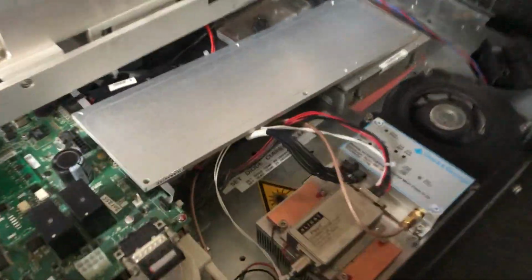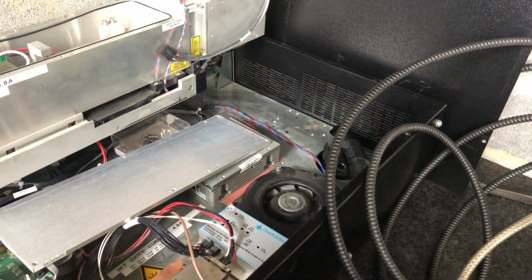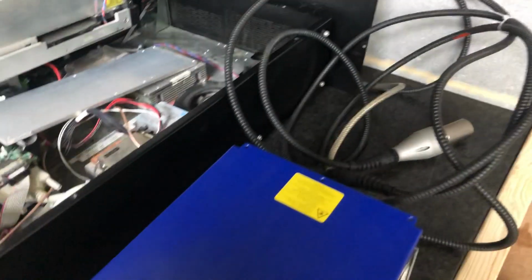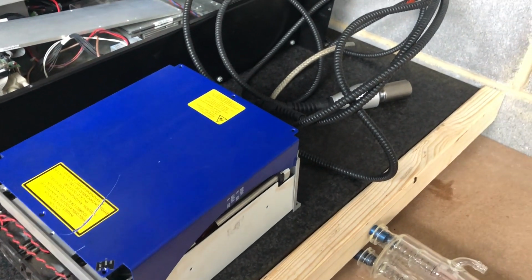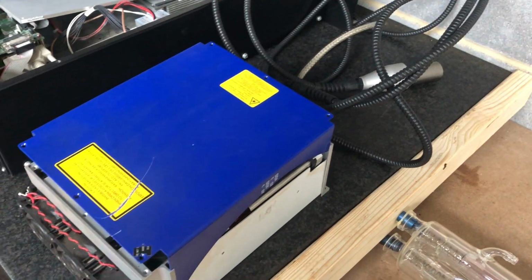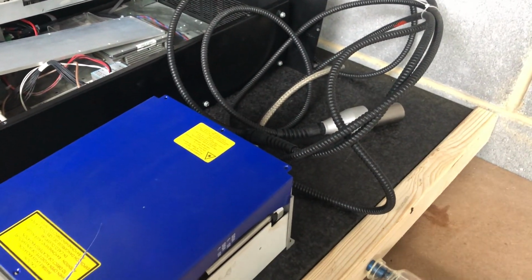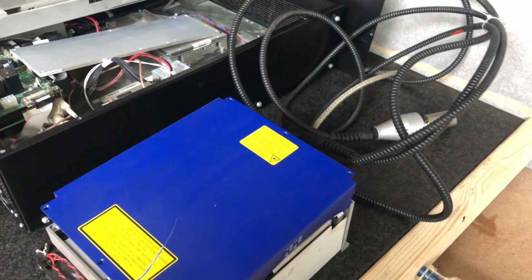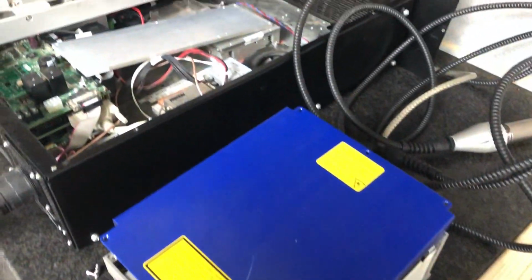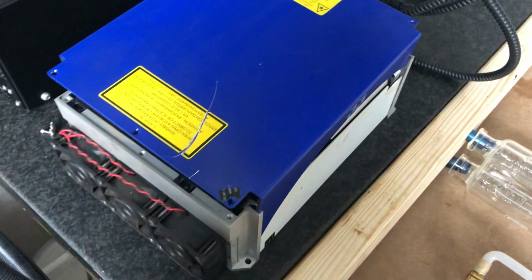It's diode, direct diode. This was superseded quite quickly by fibre lasers. YAG, yttrium aluminium garnet. We've got one missing out of this collection, which is the crystal, which is basically you had a chamber, you had a crystal, and you had heat bulbs basically to pump the crystal, and then you'd have an optical cavity, a train to pump it up using a Q switch to pump up the power. Inefficient. They have swapped them now. They do use a lot more diodes now. It's still about, it's still crystal lasers, but then it was superseded by diode, which has then been superseded by fibre lasers.